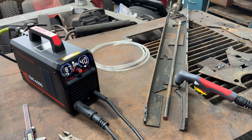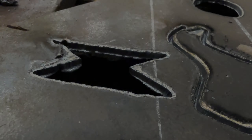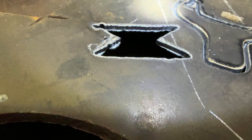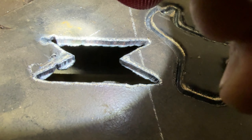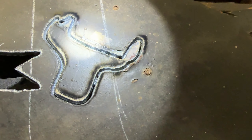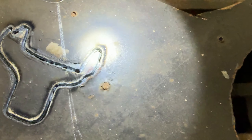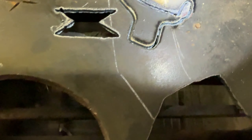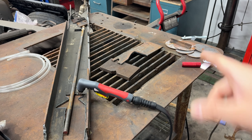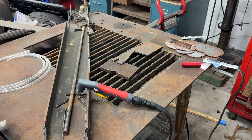Let's bring the camera close and take a look. Here's the eighth inch cut - super clean. Cutting by hand is tough but it's extremely clean. The first attempt shows where the air ran out and couldn't push the melted metal through because pressure was too low. The second cut looks a lot better. The fan on this YesWelder is a little louder than the Cut 50, but obviously a machine that cuts thicker metal needs a bigger fan.